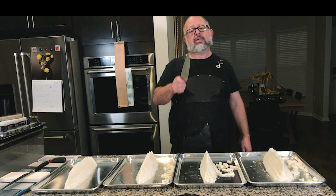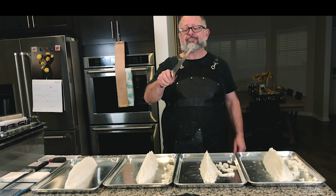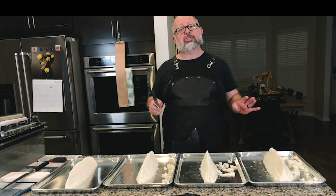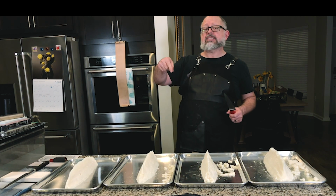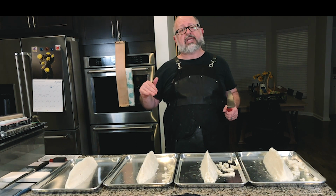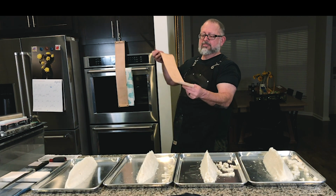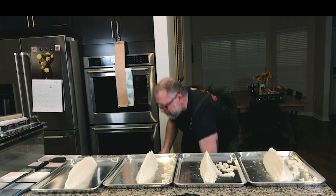So what you need to know is that the softer metal knives and some of the different metals, again, we'll have listed in the description, what they need is to be stropped. You can do leather. What really works great is kangaroo tail. And I will have two different links in the description of places you can get this, because it's very limited on the people who do the kangaroo tail. But whether you use leather, and I have leather strops, okay? I'm going to be showing you on the kangaroo just because I just needed one to show you.